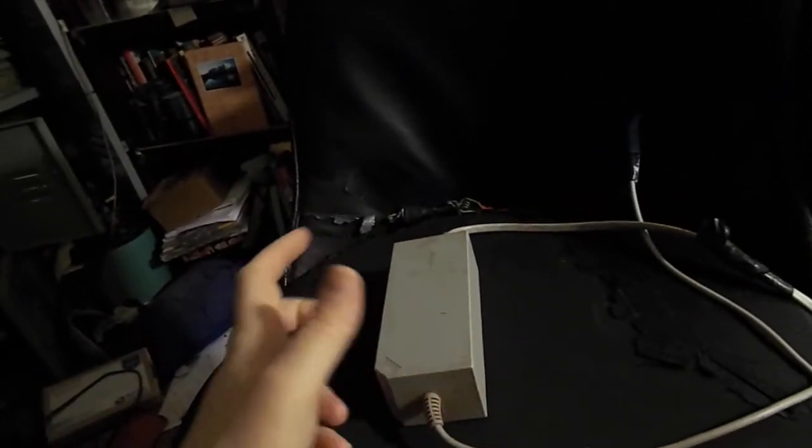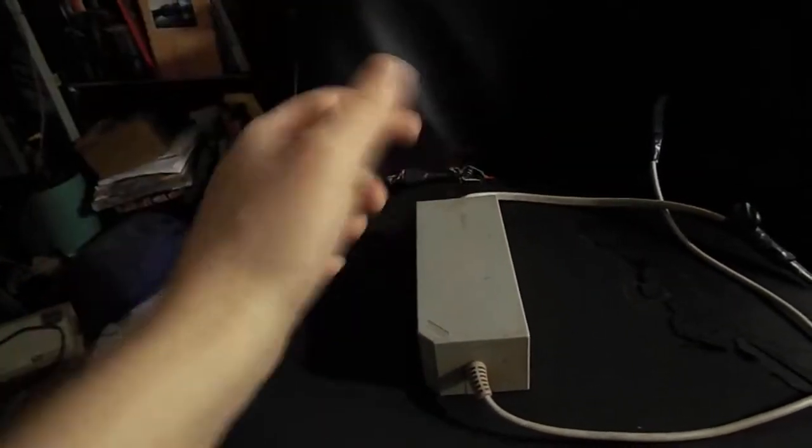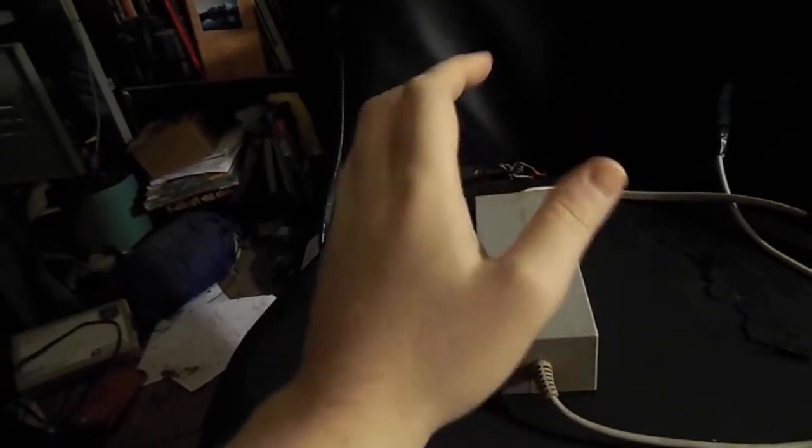Don't try running an amp through this, but if you're just hooking up a radio, totally fine. Three amps is perfectly fine to run a radio. You definitely want 12 volts at least. You can get 13.8 volt power supplies — radios don't need exactly 13.8 volts. They're actually pulling around 10 or 11, because there's a voltage regulator in the radio itself. So as long as it's above 12 — like 13.8 is fine. The radio's got a voltage regulator, so you should be fine. 12 volts, as long as the current is above 2 amps, but I would definitely want to go three.